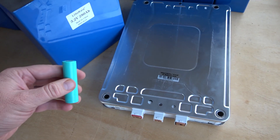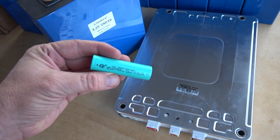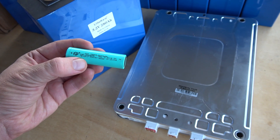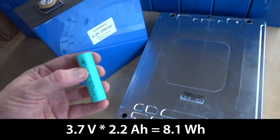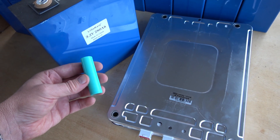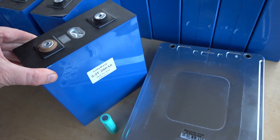Looking at the math — this isn't a Tesla cell, this is actually a much lower energy density cell, I believe a 2200 milliamp hour or 2.2 amp hour. If you take that times the nominal voltage, you can get the capacity — this is under 10 watt hours per cell. I believe the Tesla 2170 cells are 14 or 15 watt hours, maybe as much as 17 to 18 watt hours per individual cell. So that's tiny in terms of the 900 watt hours in the large prismatic cell.